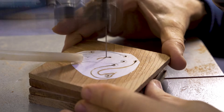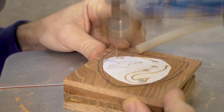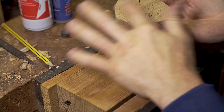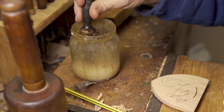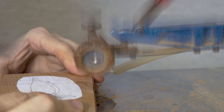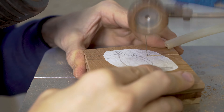This next project is slightly different — it's a swan, and we are using the process of line art. That is where you use lines cut out on your scroll saw. You drill a pilot hole and then use the pierce work to cut out lines on the scroll saw and create a rough outline, an image of the swan design. We then cut a basic outline, put fridge magnets on the back, and again add three coats of shellac sanding sealer applied in the direction of the grain.